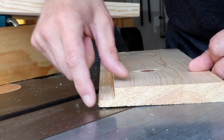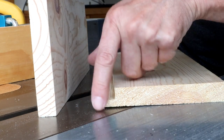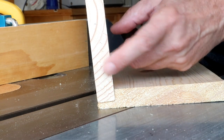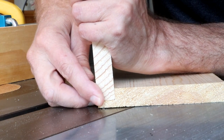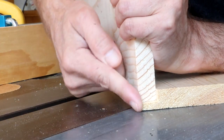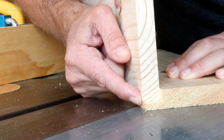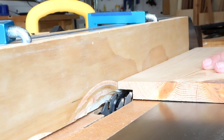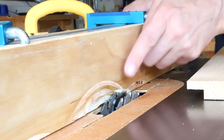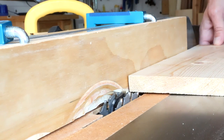After the test cut, I can see it's cut much deeper than expected, so I'll drop the blades down a bit. I'm more concerned with the width. I want to test-fit the actual panel that will be used for the box and make sure it fits flush in the rabbet — there shouldn't be any overhang. Feeling it with my finger, it needs to be just a little wider. I'll reset the depth by dropping the blades down, then move the fence back slightly and run another test on the side of the board.